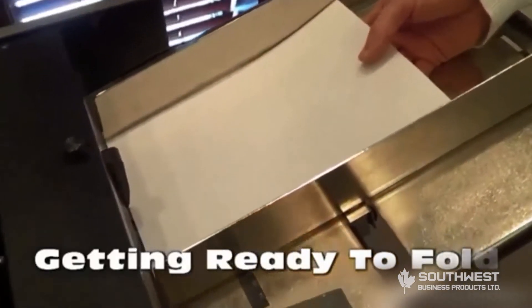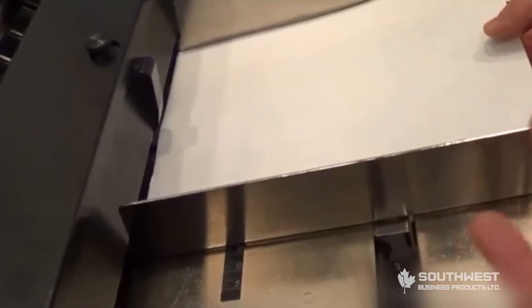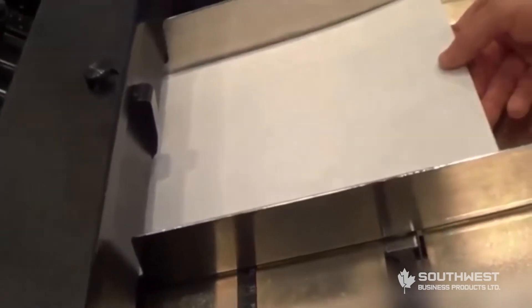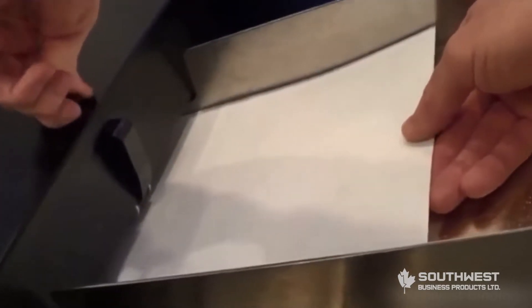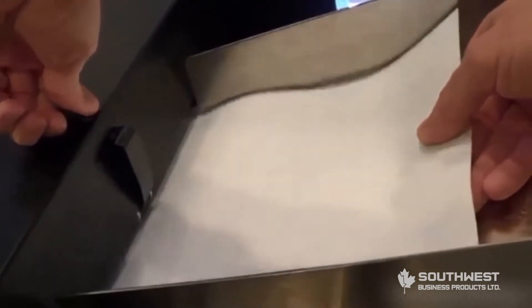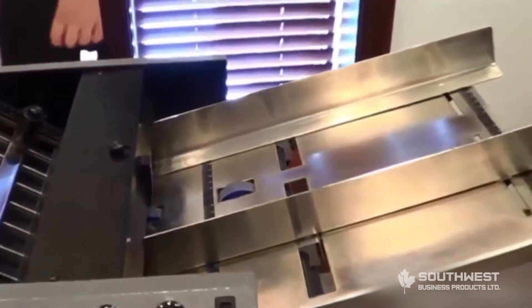Once you have set up the components and the paper, you also need to set the sheet separator for the paper you are running. You can see the paper sliding in and out of the sheet separator clearly. This knob adjusts it — pull it in and out until you start to get some grabbing by the sheet separator, which indicates a good feed. You want just a slight grab. This setting is variable, as climate conditions, humidity, and similar factors affect how paper feeds in a folder. You cannot simply drop your stack on and walk away, as environmental conditions can change feeding behavior.